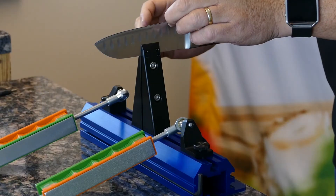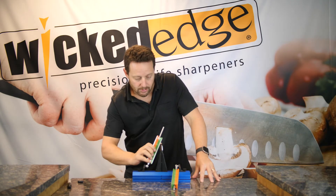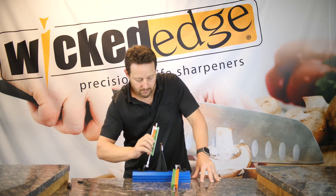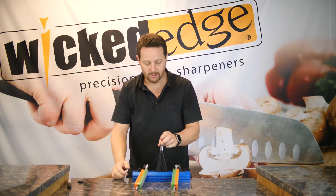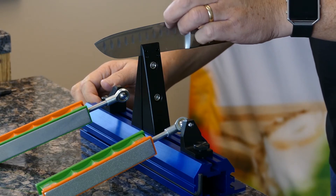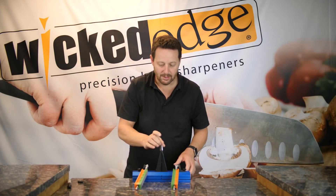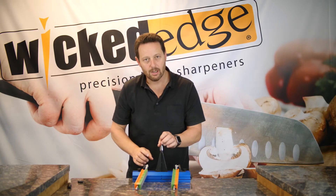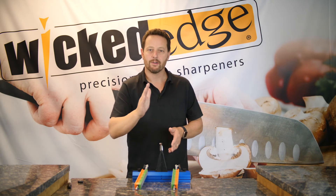What I'm feeling is just my fingernail hitting that little curl that's coming over the edge. There's one spot right back here where I don't have a great burr, and in this situation it's perfectly okay to just focus on that one area. That's another five quick strokes. Now I have a fantastic burr — you can probably hear this again. Just to demonstrate the point, if I go from this side, you don't really hear anything. It's not catching on anything. It's only going to catch on the opposite side. So this side I'm very confident has the burr.